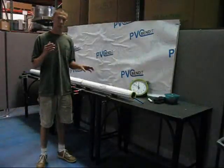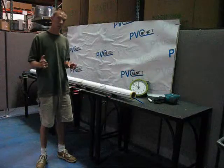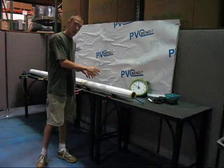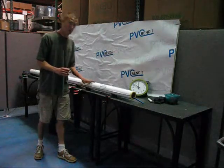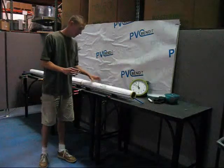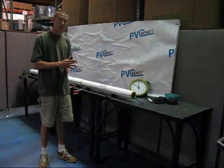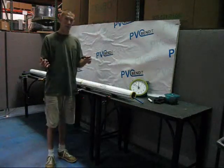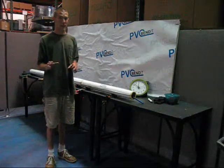On a pipe this size, I really don't recommend touching it with your bare hands until you're used to the heat. With smaller pipes you can rotate bare-handed without much problem, but with a pipe this size, until your hands are ready for the heat, don't touch it. You'll know it's getting soft even through your gloves. When bending pipes larger than one and a half inches, put your gloves on pretty much every time you touch it, even when you rotate it. Don't let the fact that I'm doing this without gloves make you think you can — this is hot stuff.